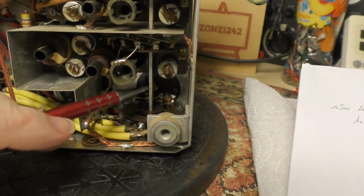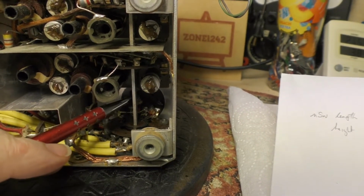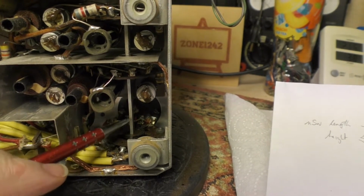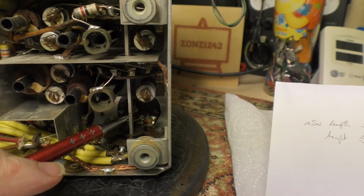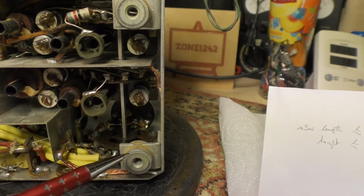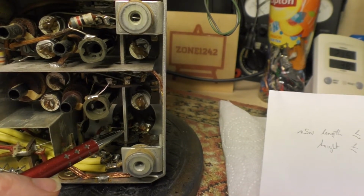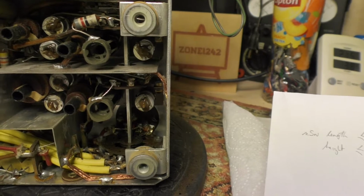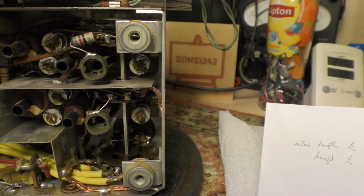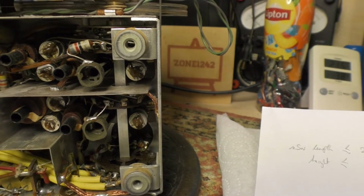Okay guys, so what I've decided to do as a first attempt at coming up with a MacGyver solution here is this: this is the center shaft of the band selector switch. In what I'm calling the 6 o'clock position, where it's directly facing, this is the FM position. If I go one more, the 7 o'clock position, that's the pickup. And then the others are in the 5, 4, 3 positions.